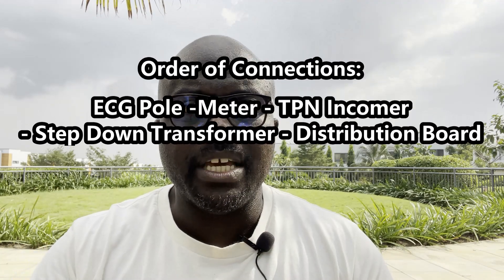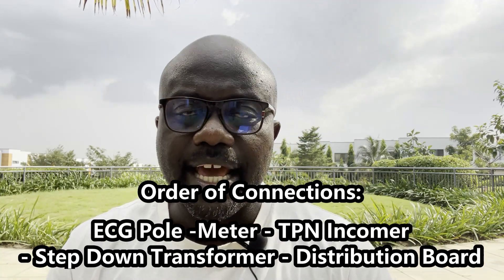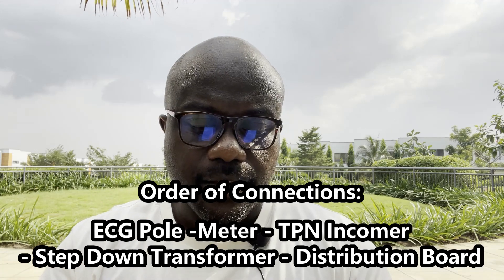Another diagram shows how the elements come together. The first box is ECG — your power supply comes from ECG from a pole near your house, be it single phase or three phase. That goes through the ECG smart meter, then to a TPN incomer, which is your main incoming isolator with fuses for all phases. From there you take a single phase into the step-down center-tapped transformer. From that transformer you have three lines — line one, line two, and the neutral, or as they call them in the States, hot one, hot two, and neutral — which go into your distribution board and you can distribute throughout your home as you please.